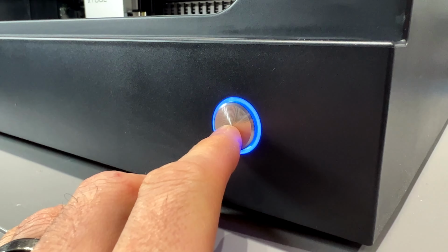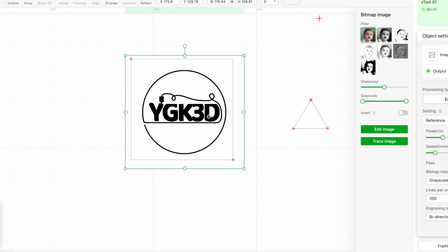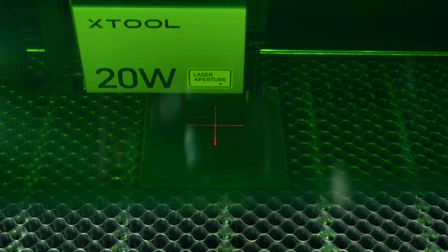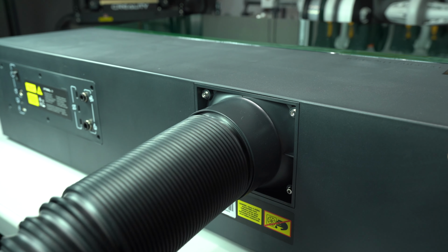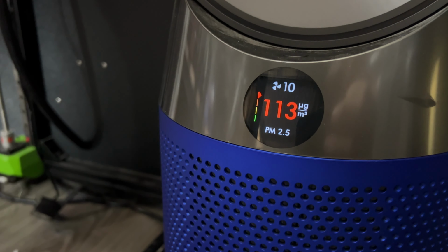Use the marking feature to determine the location of your workpiece. Adjust the design accordingly. You can use the framing feature as a sanity check, but it's no longer critical. Close the lid and hit run. No safety glasses required and no opening of doors. The built-in exhaust fan and hose can be used to vent the fumes out a window, at least in theory. More on that later. So it's the same number of steps, but the workflow on the S1 is safer, easier,